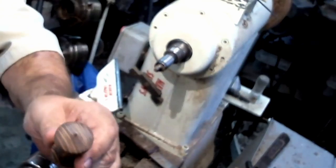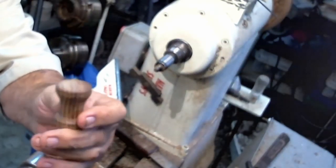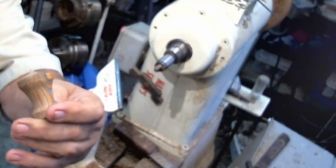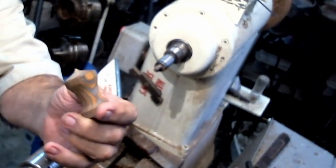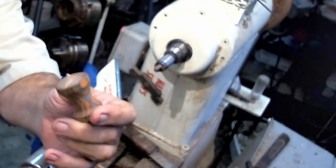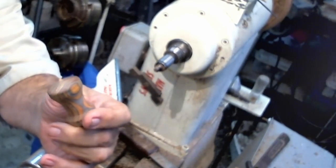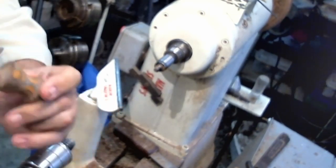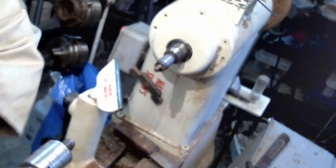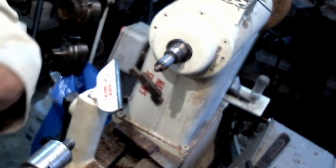And this is a piece I did out of Spectraply. And it's the same brown and gray. Did a little simple shape. I didn't want to get into art. I wanted to get into how to turn simple shapes. But I did this whole piece here with the 8-inch Ellsworth type gouge. Was it cut nice for one reason? I didn't abuse it. And I say abuse it because when you get it, it's going to be square like this.